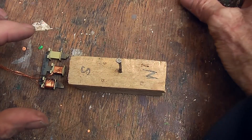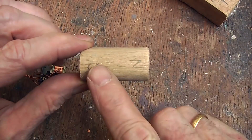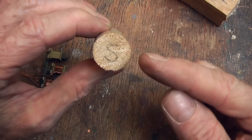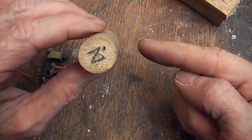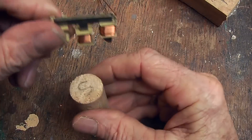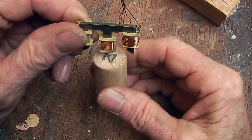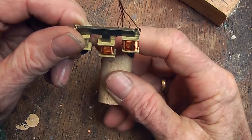The way they did that is instead of taking your magnet square like that, they turned it into a cylinder. And of course it will have its north and south poles. Now if you turn the magnet this way, you are going to have a face that is entirely south. If you turn it the other way, you are going to have an entirely north. If you put a pivot point through here and let it spin this way, that is basically what the motor is doing traditionally - it will spin this way as the magnetic fields operate between the magnet and the electromagnet coils.